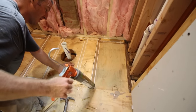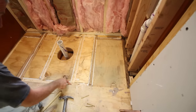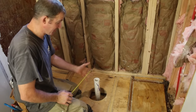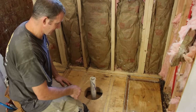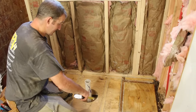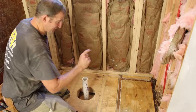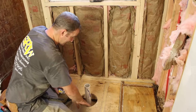I'm going to use some liquid nail to fill in some of these grooves just to keep the thinset from oozing down in there — just to make it a little bit easier when I go to thinset over all of this. I wouldn't do this if you're going to thinset right away — just move on to the thinset area if you're doing the pan the same day. We're doing the pan another day. The first thing you want to do is determine where the drain location is. If you have the ability to install the drain afterwards it makes it a little bit easier, but if a plumber already set it you're stuck with what you have — just measure off that, cut down the pan, fit it. Make sure you have an 8-inch circle cut around the plywood of your drain to ensure enough room for the recess of that pan. The pan has a really large reinforced portion that sticks down below the subfloor, so make sure you're not fighting yourself with too small a hole.